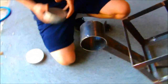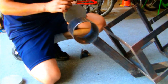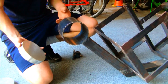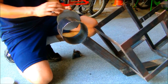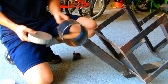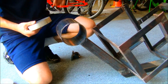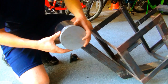We have these aluminum discs and also steel discs which are a little smaller. They're going to be cut down just a little bit — right now this tube is 5 inches in diameter and the disc is 5 inches, so they don't go in. We're going to have them cut down by a quarter of an inch, which is one eighth of an inch on each side, just more than the thickness of this metal by five thousandths, so in total we'll have one one-hundredth of an inch of play.